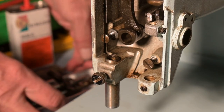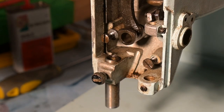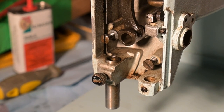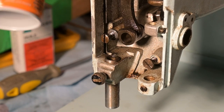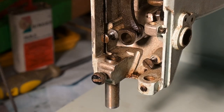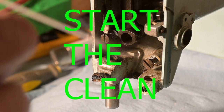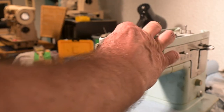And then in this magnetic tray is where I have all the needle bar rocker bar assembly. So that's going to get cleaned real soon. Now I can get in here and clean up this, start spraying in here. I've almost got the electrical out. I can't move the light receptacle yet, so I may end up just putting plastic and shop towels over the plastic and going ahead and soaking inside here anyway. I'm going to be using this Jigaloo — this was referred to me down in the marina at the boat yard a few years ago. The other thing I also have is mineral oil, and that's what I actually have in here. I've loosened this screw so I can pull the pickup lever off of there, so I'll see if it'll come.